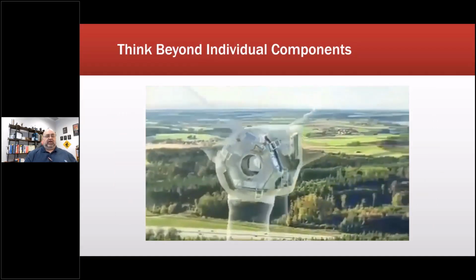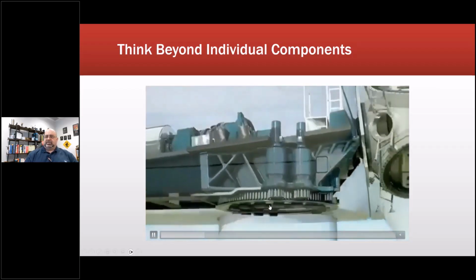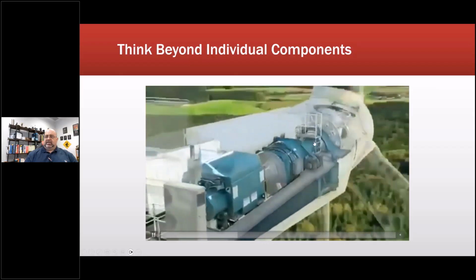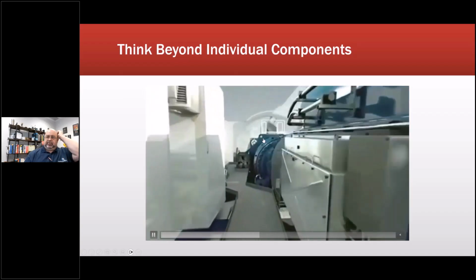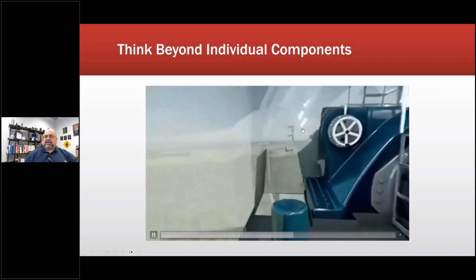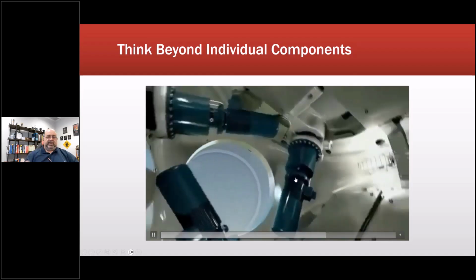Okay, so let's see how this works. Just so you understand wind turbines, this is the yaw deck. Just below here, that is the yaw with gearboxes and AC motors, generator, gearbox, main shaft, and then it all attaches to the hub. The hub actually sits and puts strain on that main shaft, so that is all connected to that. There's all kinds of protections in place, and then inside here, and in most designs, they're DC motors. There's the pitch motors. These will tilt and pitch the blades.